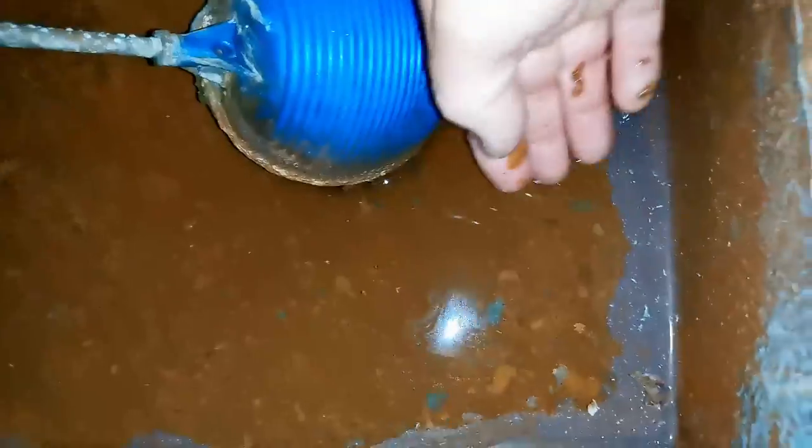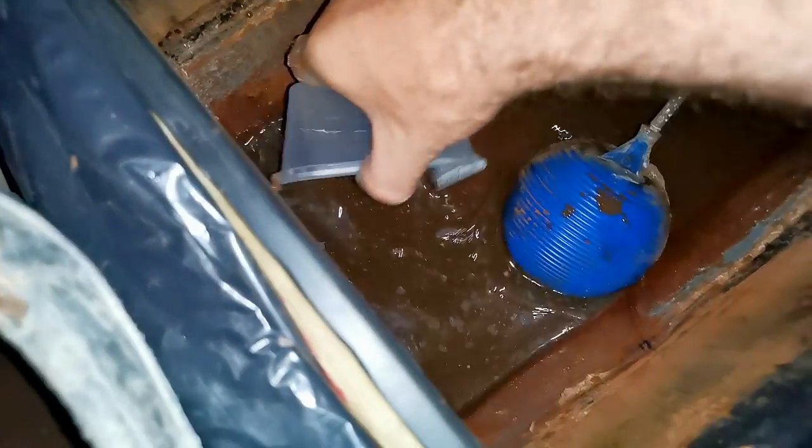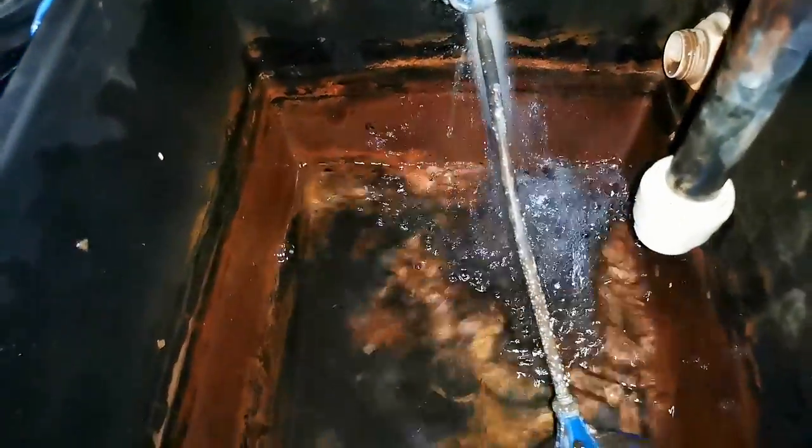One last thing — here is a loft tank where I drained the system for a different job. You can see the tank is nearly empty, but in the bottom there is horrible brown gunge, and you don't want any of that stuff getting into your system because it may cause problems by blocking things up. So with the feed plugged off you could drain this tank, take out all the water, and get rid of all that gunge in the bottom. You'll need to turn off your float valve — you may need to tie it up or turn the mains water off. There's no easy way of doing it — you've literally just got to keep scooping it out, then get a sponge and wipe around the sides. This way, when you remove that plug from the feed pipe, none of this gunky stuff is going to get into your system. You can see now I've cleaned this tank out — it's nice and clean and fresh clean water is now going into the system.